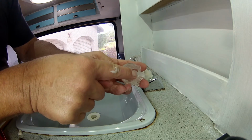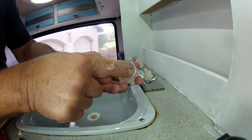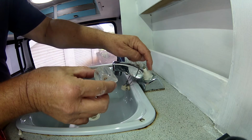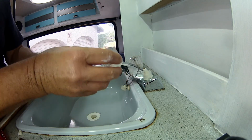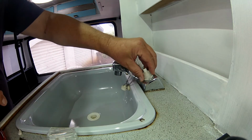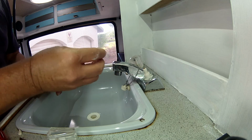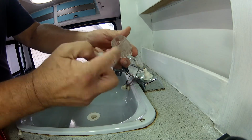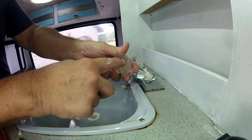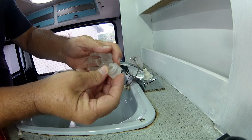Look inside the unit, you'll see there is a little rib. That is a stop that prevents you from over opening the tap and or over closing the tap. And then there's a collar where it stops again. Take that collar off. You can actually see on the collar the little rib. There's the rib, pushes against that for open and maximum close.